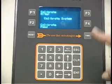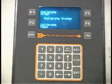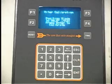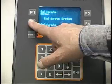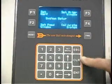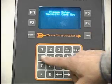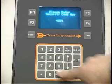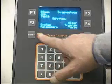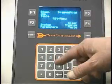To calibrate the system, at the start of a shift you calibrate the tilt by positioning the blade exactly 90 degrees with a square, pushing the miter button, and once at 90 degrees pressing enter — the tilt is then calibrated. Calibrate feed doesn't do much manually because it calibrates the feed every time it starts a job to find where zero is. More gets into the area requiring a security code. With code 4821, you can clear all jobs, clear programs, run diagnostics, and look at system parameters — many variables for fine-tuning feed positioning, tilt positioning, and similar machine settings.